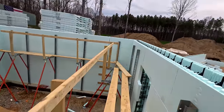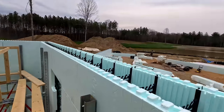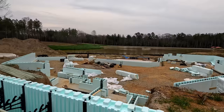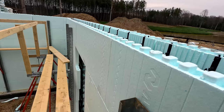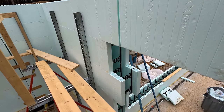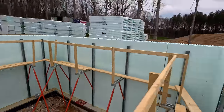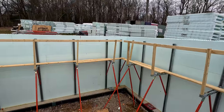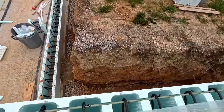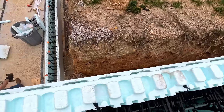The underground theater is stacked and rebar is in. This is the level of the entire basement — looking straight out that way will be the whole level of the basement, so this is how far we have to come out everywhere else. I've got to build the lintel for this — I'll show you all that, it's pretty cool. I've also got to put strapping up the rest of the way on those two common seams, and then this area is ready to pour. You can see how the brick ledge works out — it's pretty cool.